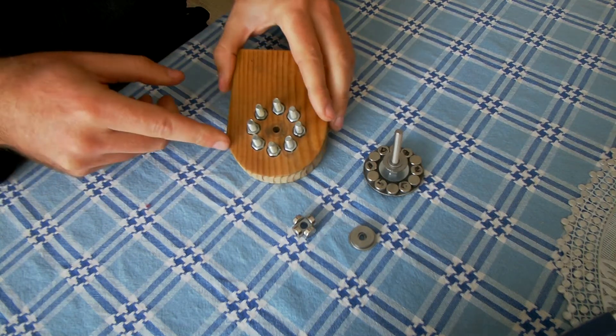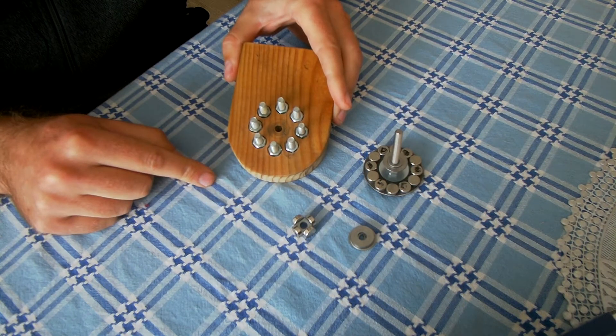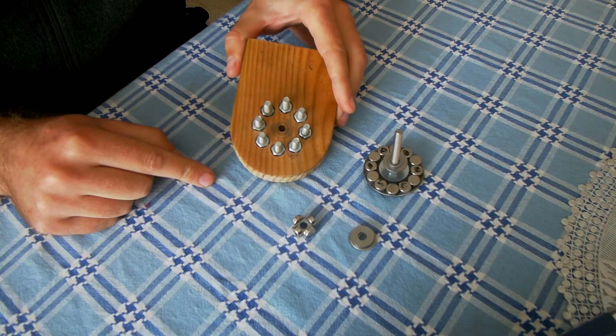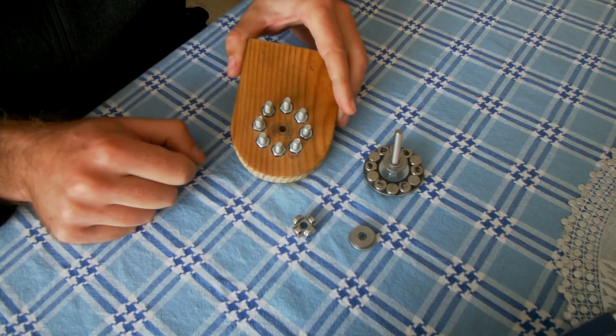The ratio of the number of steel inserts relative to the magnets is something that you can calculate. Just go to Wikipedia and have a look under second order magnetic gears and it will tell you exactly how many steel bits you need depending on the amount of pole pairs on your gears.